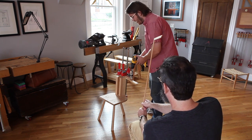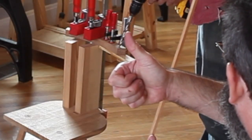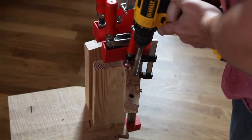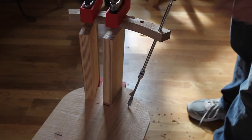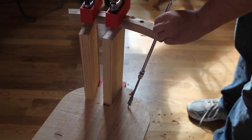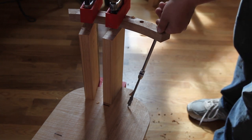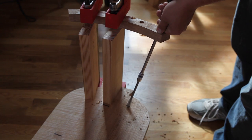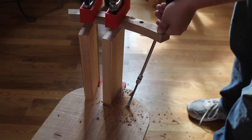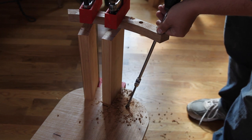I'm going to set the bit again in my awl point and wait for a thumbs up from my boring buddy to make sure I'm at the right angle. Now that I've got my crest drilled, I can put in my little extension and drill the seat mortises for the spindles as well. I'll keep my bit centered in the hole drilled earlier and enter quickly using the spade bit. You'll notice on the spade bit there are little notches that indicate when I've gone deeply enough — and there we go, we're at the bottom of the bit.